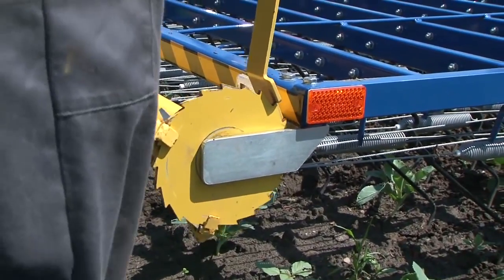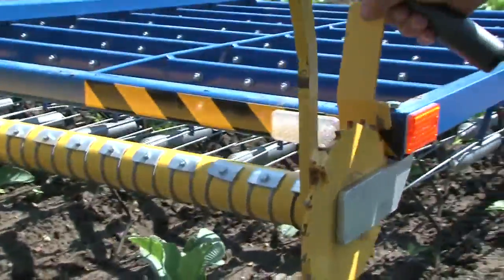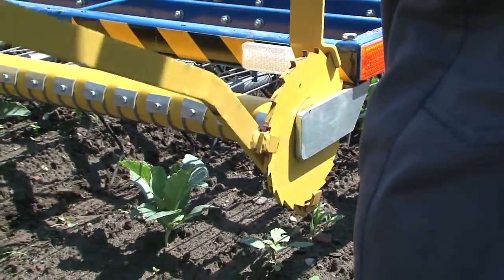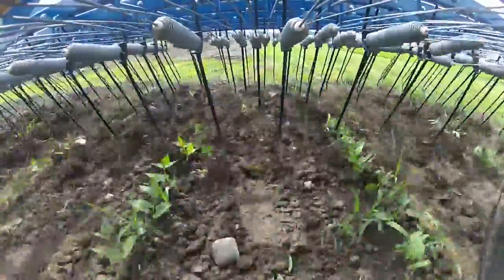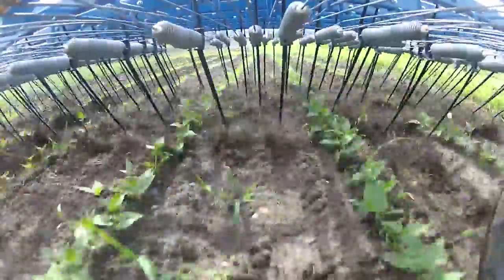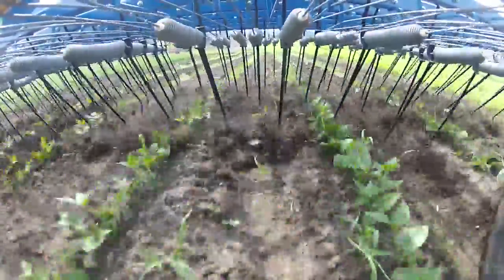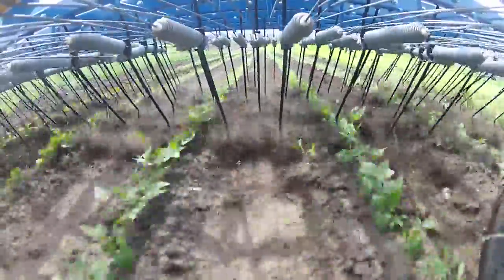The tension springs and thus the bearing pressure of all tines can be centrally controlled hydraulically or mechanically. The design also has advantages in raised beds. The tines in the ground under greater pressure pull and uproot the weeds, while the crop plants on the bed are gently cultivated with a maximum working depth of 2 centimeters.